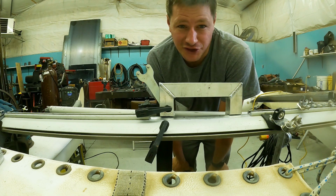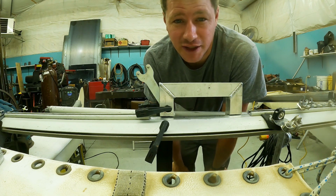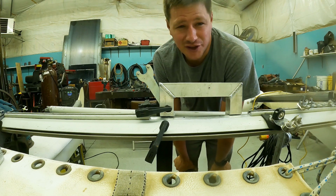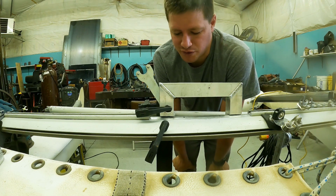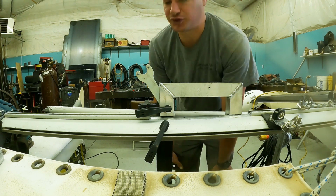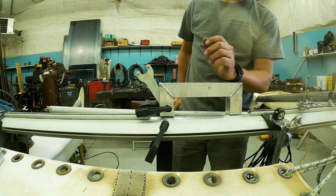So we're gonna finish this out with the Lincoln MT210 on the spool gun. I'm set at 385 inches a minute and 20 volts, which is what the tool preset is for just under 1/8 inch aluminum. So let's see how this goes. I haven't spool gunned for a while.